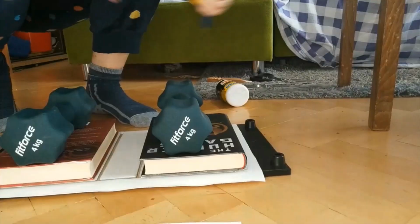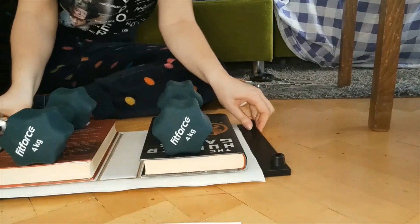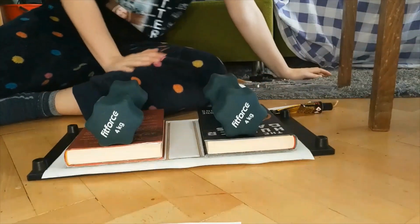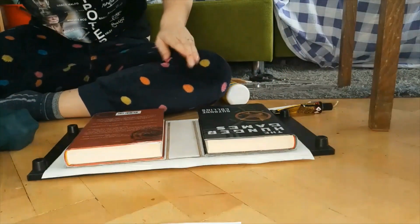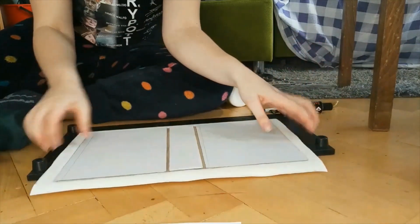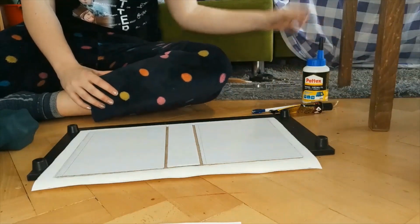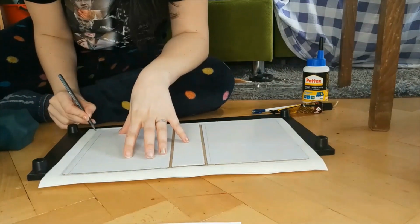Okay. So, here, the best thing to do is set up a stopwatch. So that's what I did. And I'm going to apply contact glue on each side, starting with the longer ones. I had to apply contact glue on both surfaces and then wait 10 minutes. Oh, but before I do that, I should probably cut the corners, right? Oh yes, I should cut the corners. Yeah, okay, let's do that.